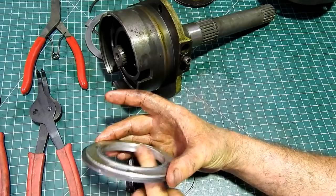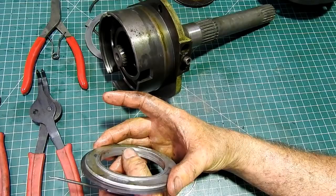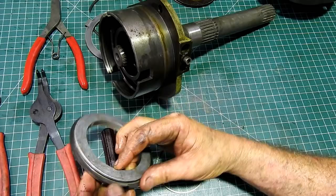Have a look at your piston — on ours you can see that grey mark just in here, that's where the piston ring has been sitting most of the time. That's okay. Feel that — that's smooth as smooth can be. On assembly we'll just polish that with a little bit of 600 paper just to make sure there's nothing in there that we don't know about.